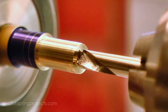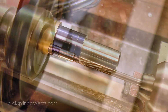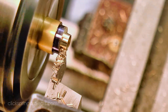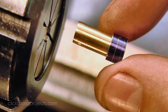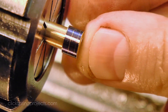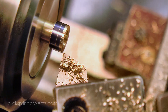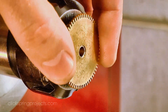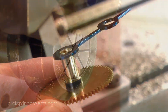Next the part needs to be reversed so that the wheel seating can be turned. When using ER collets to hold short parts like this, it's difficult to get the collet to hold the part accurately — there's just not enough inside the collet and as it closes down it distorts and throws the part off centre. One way to get around the problem is to push a small scrap of the same size into the rear of the collet, then put the part in as normal. The collet grips as if it's holding a continuous part and gives the accuracy you'd expect. The seating for the hour wheel was then turned so that, just like the hour hand, it's simply held in place with an easy interference fit. I may eventually choose to permanently bond these parts in place, but for now I'll leave them as is so that I can still disassemble them in the future.